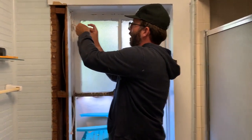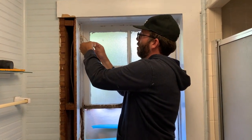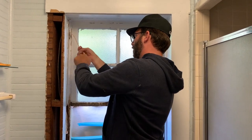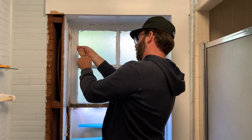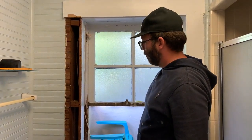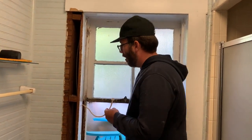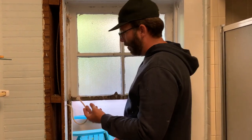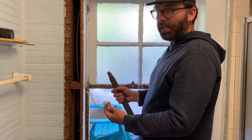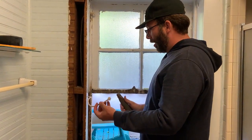So first I'm going to tie a pretzel knot up here for the part that goes into the sash. The reason we want to tie this first is that when you put it up here, the pretzel knot actually keeps the rope from falling through. Now this time I'm going to have to tie it using a slightly different knot than I did earlier because the way I tied it earlier I need the entire rope, and I don't have it here because the other end is up here. So this is also an okay knot.